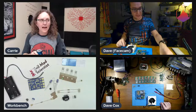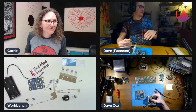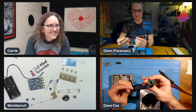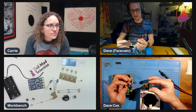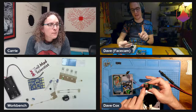I chose to do this in maybe the most silly way — what I should have done was spin a board, but I needed some meditating downtime. So I chose to do a lot of super fine soldering. These are wire wrap wire, like 30 AWG multicolor stuff from AliExpress. I spent a couple evenings slowly assembling these units — there's going to be eight lights in total. This is the DMX-compliant input/output module. This little guy is the RS485 chip. This is the optional terminating resistor — if you're at the end of the line, you flip this switch and it reduces reflections, giving better signal integrity. Sometimes it doesn't work on longer runs without it — I've learned that the hard way. There's also an opto-isolator and a galvanically isolated power supply, which is specified in the DMX spec.